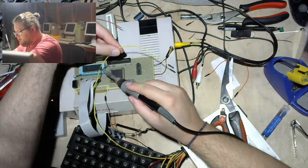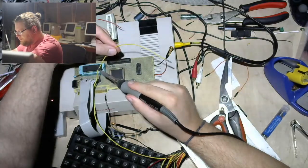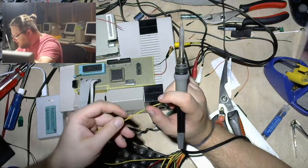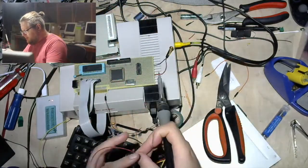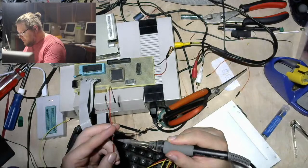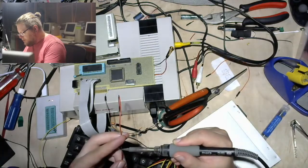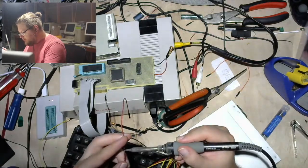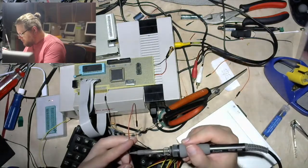And that would be an interesting one to debug because the Atari 800, just the Atari 8-bit series, unlike the Apple II, which has a ludicrously simple floppy mechanism where the controller barely exists and 80 or 90% of the floppy routines are done in software, the Atari 8-bits, like Commodore machines, use a serial interface to talk to the drives, and the drives have an onboard processor that actually does all the work. So the Atari drive is actually a machine in its own right.